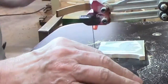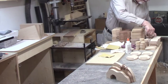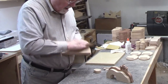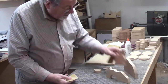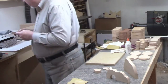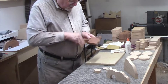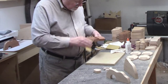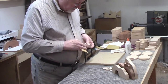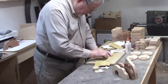All four figures are now cut. Next step is the glue-up. You can see the parts for several resurrection scenes stacked on the workbench, ready to assemble. The edges of any pieces you cut can be sharp, so I take a piece of 120-grit sandpaper to ease them over slightly — they don't need as much rounding as you'd get from a router. The bottoms of the sepele pieces were too rough, so I cleaned them up with my disc-belt sander combination tool. The figures also needed a little sanding on the back for slight tear-out from the scroll saw blade; I accomplished this by laying 120-grit sandpaper on a flat piece of masonite and rubbing the figures against it a few times.